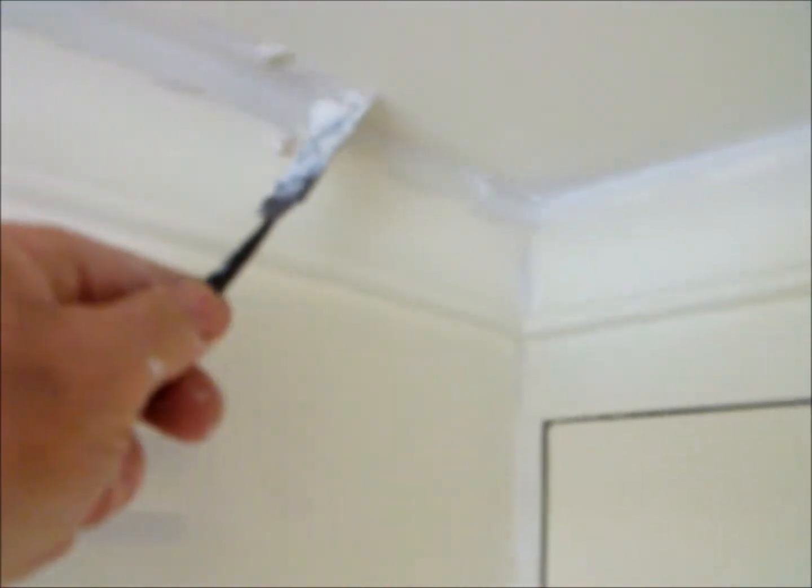And continue filling all this cornice up. There's 2 rooms to do, and fill the vents up too. Check for any other holes in the house also, maybe around the light fitting. This section is filled up along here. Scraping off the excess cornice cement at the moment. The vent is coated in it. When I finish that, I'll give it a light brush with a wet brush.